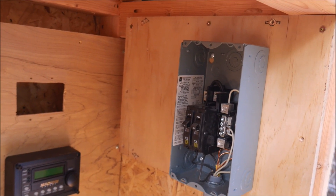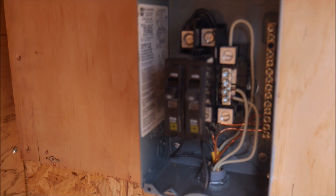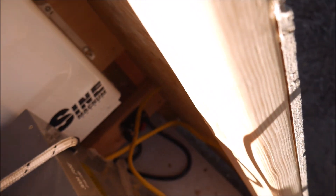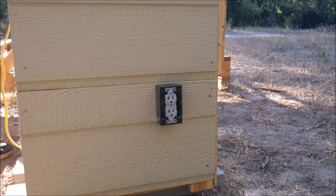I picked up a small load center and heavy gauge Romex from my old house to wire the inverter AC output. I mounted it up high on the plywood on the right side of the enclosure, because that's the side the inverter's mounted on. I previously used this in my solar shed and it worked great, so I kept all the wiring as is. I won't cut the Romex to length — I just wrapped the excess in bunches and zip-tied them out of the way. I fed one circuit through a hole on the right side down low and mounted a weatherproof bell box with a 20 amp outlet. I'm going to use this outlet to run a 10,000 BTU dual duct portable air conditioner in the bedroom of the travel trailer overnight.